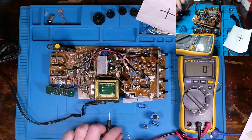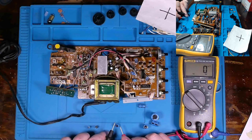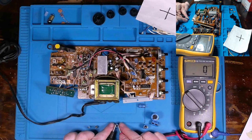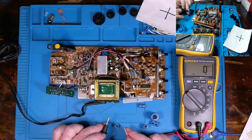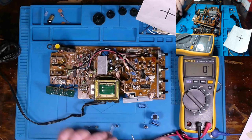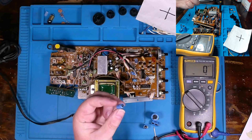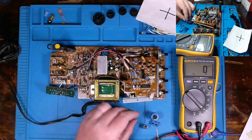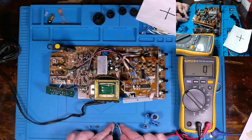All right, so this was a 220 microfarad cap. Which, by the way, even with the capacitors I replace them with, if they're not within one or two microfarad above or below the assigned value, I don't use them. Actually, the first capacitor I pulled out to replace this with was reading like 490 and I didn't use it. So I threw it away. But that's just me trying to think of the customer and longevity.